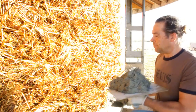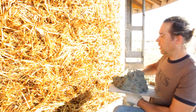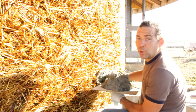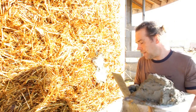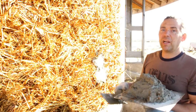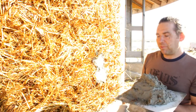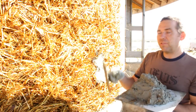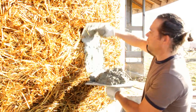So to get started, what we're going to do is bite off a nice bite-size portion, push it on, and then push up and smear it on. Something else I should mention: it's a really good idea to take some loose straw and throw it down on the ground where you're working. The reason for that is because stucco is going to fall off — you're going to have some that just clumps off. What you do with that is pick it up and use it to fill in any holes or patches anywhere along the line. So again: cut in, push it on, work it out.